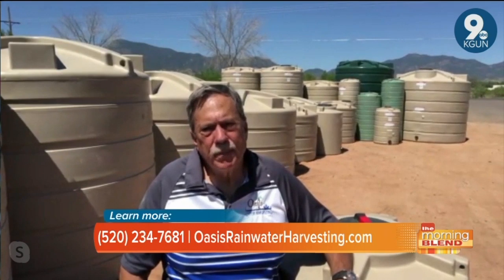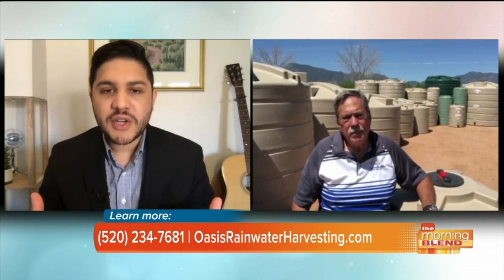The first question I have for you is, how much water could somebody get off of a 2,000 square foot home? Well, the formula is one inch of rain on 1,000 square feet is 600 gallons. So one inch of rain on a 2,000 square foot home, you're going to get 1,200 gallons. That's a whole lot of water, and we're not using up the groundwater — we're getting that fresh rainwater.